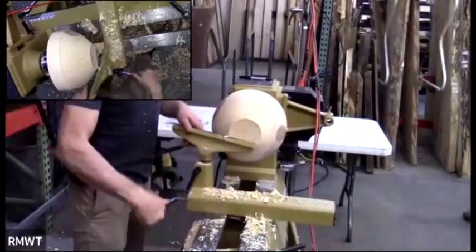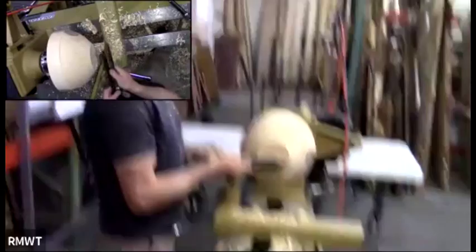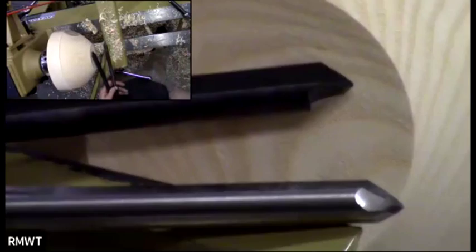Two gouges. One is an elliptical flute and one is a V flute. If you were buying an American-made gouge, that would be Carter, D-Way or Doug Thompson. That would be a V gouge, the black gouge. The other one is a Canadian tool by One Way that has an elliptical parabolic flute. They're still both Vs, the same type. The parabolic is still a V, the elliptical is still a V. I'll draw it on the board in a second.